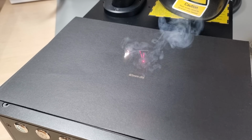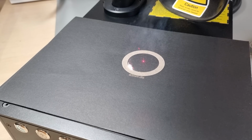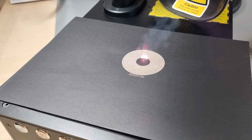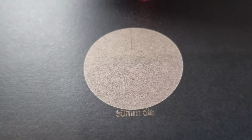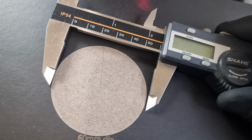This type of engraver is so fast because unlike our blue diode machines, it doesn't have to move around a big heavy gantry and an X-axis on top of that. It uses 2 lightweight mirrors to steer the beam, which allows the focal point to travel with speeds in excess of 1 meter per second. This kind of galvanometer steering comes with its own set of problems, and it doesn't help you if you want to remove material, i.e. cut through something. But it certainly allows you to cover areas with incredible speed.